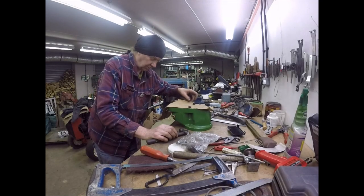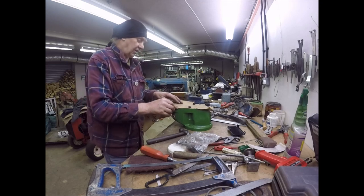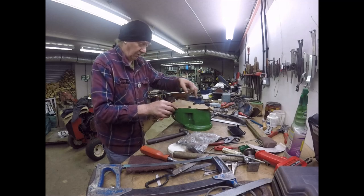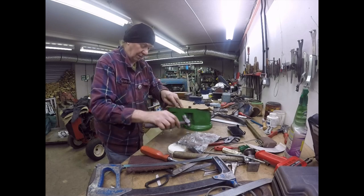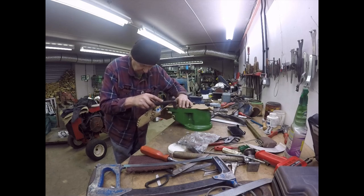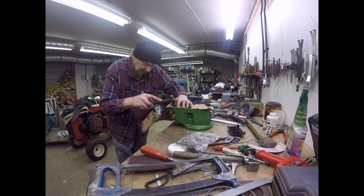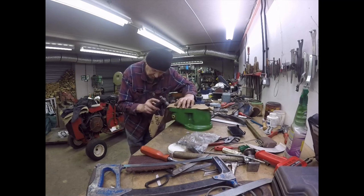Right chaps, I nearly forgot, and I've only just got enough gasket paper so I'm going to have to order some more tonight. Start off: get a piece of gasket paper that's big enough — this is just big enough. Find two holes in the casting, take a small ball-peen hammer, tap tap tap tap, and you'll find that the paper will just drop out for those holes. Then tap your way all around the edge and you'll find the edge is easily sharp enough to cut the gasket paper.